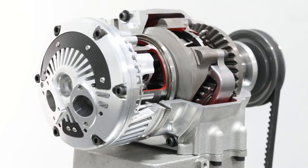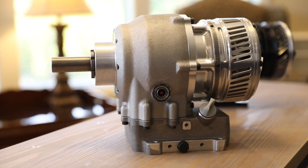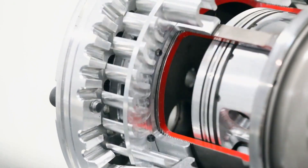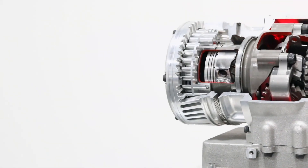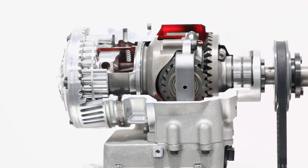Avadi's rotational motion improves torque. The ratio of the rotating gear set provides a reduction to the output shaft, which exponentially increases torque. The same motion also rotates the fan blade for air cooling and provides an inherent balance effect, which reduces vibration.